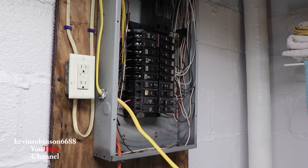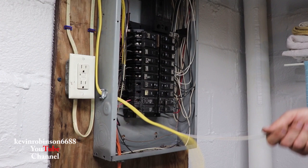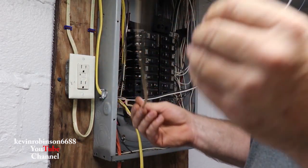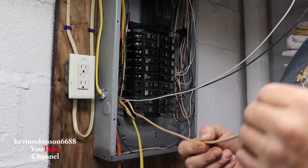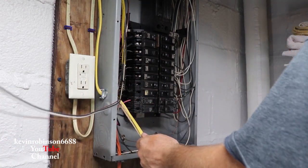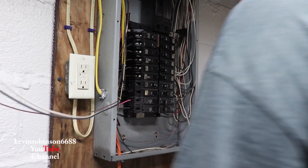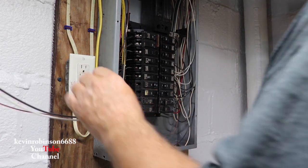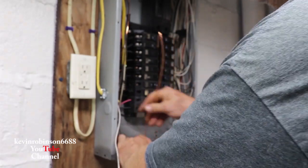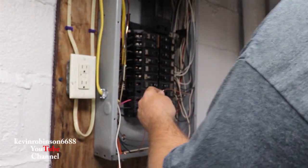If you don't get it all cut, what's not cut should peel right apart because you got a good score on it — that was a very light cut. The main wire you've got to be real careful with is the ground because the ground doesn't have a coating on it. If it were to swing in there and hit one of the power wires that may be bare, you're going to get a jolt. I'd suggest if you're not very good at this, just turn the main breaker off. The first wire I'm putting in is my ground — it's going to go on this side over here. Get that extra wire cut off.